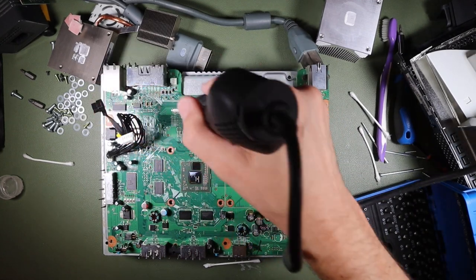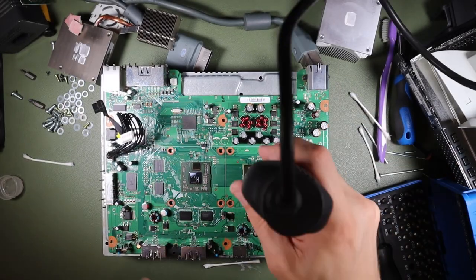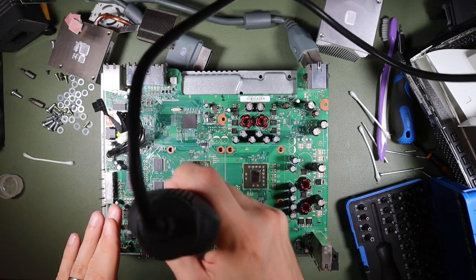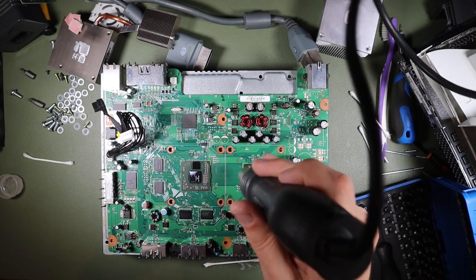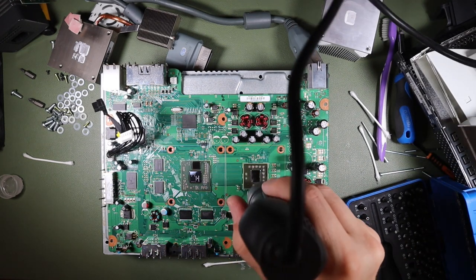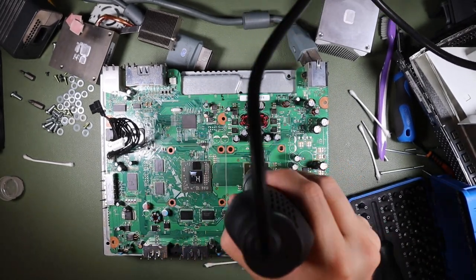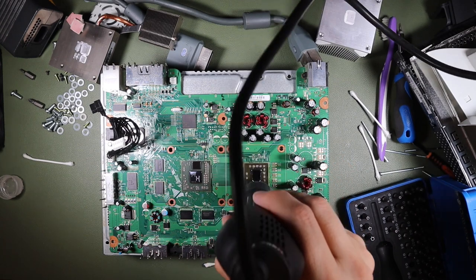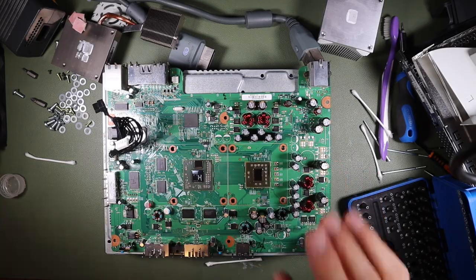I'm just going to warm the board for a few minutes, and then apply a little bit more intense heat to these two processors — the CPU and GPU. This fast-forward portion is running at about five times real speed. It seems I spend more time concentrating heat on one chip rather than the other, but I think it's just the way I recorded it — there's probably footage I didn't capture of me heating the other chip too. Now we're going to let it cool and look at it again tomorrow.